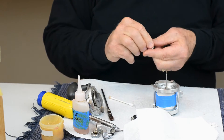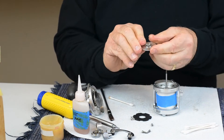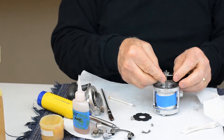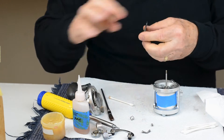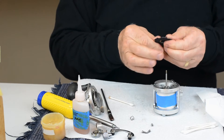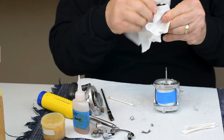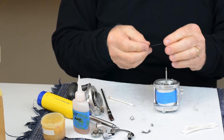This also feels in really good shape. Randall takes excellent care of his reel, so I would expect nothing less. Here's one of our drag plates — a little bit of oil on it. Two sides to it: one with bumps, one with a cutout that fits that bearing, so let's put it in place. Now we have a drag washer — this is Cal's grease. We're going to rub it back and forth. This reel has probably caught a couple of hundred fish, no less, some of them quite substantial. I was just amazed the first year — I did not think this reel could put up with what it did, but it did. And the drag plate looks almost brand new.